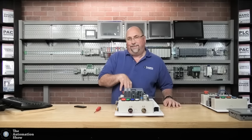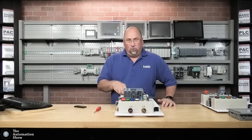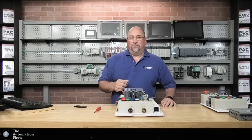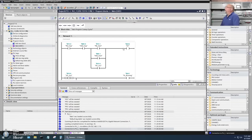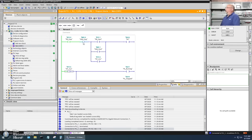It doesn't start. Well, unlike the stop button which is normally closed, my HMI stop is not normally closed — that button will only turn on when I press it on the HMI. So that's stopping our logic. Let's monitor the program — I can press the start all day long, but since my HMI stop doesn't even exist on the network yet and will only turn on when I press stop, it's blocking the code. We need to fix that.